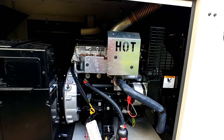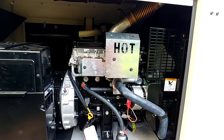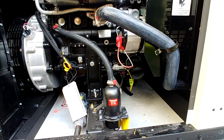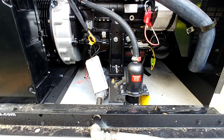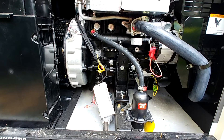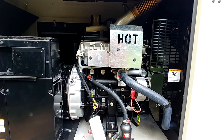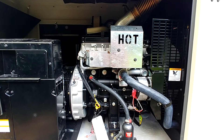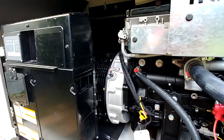This is the inside on this side here. It's got a 2.5 or 2.4 liter four-cylinder car engine in it. It takes standard spin-on filters, though you have to buy them through Cummins, as well as the spark plugs. It comes with a coolant heater from the factory, which is pretty nice. It also comes with the battery charger from the factory. There are some good options to add — you can get an upgrade to the excitation system, and you can also get a heater for the generator alternator itself, which is right back in here.